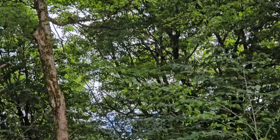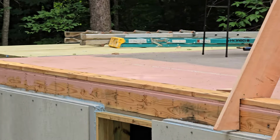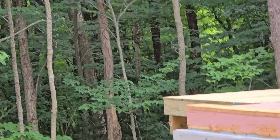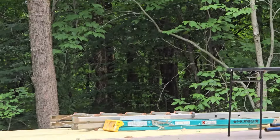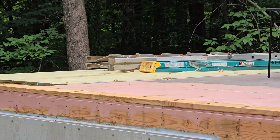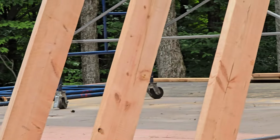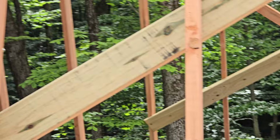Which, if I can zoom this down, okay, so out on the end of this you can see the deck, which is 8 by 18 feet, and for reasons I'll explain later, the overhang is going to come down and eventually would hit the railings on either end, so I didn't want to go 24 feet out. It would have created a collision point, so I tried to eliminate that. So anyway, details, there's a lot of bracing in there. I'll explain in a minute.